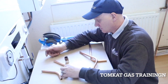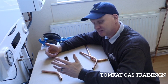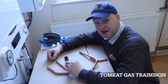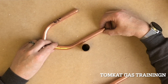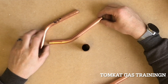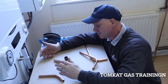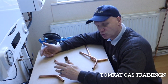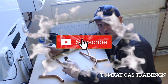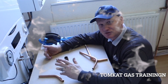If the distance is less than 50mm, you might actually need to use less than a 30 degree angle. The less the angle, the closer you can get to the pipe. We've still got to make a judgment on which angle to use, but we always have to remember that if this is a hot pipe and a cold pipe, we need to keep them 25mm away from each other so we don't get heat transferred. And we've also got to think about what it looks like — does it look neat?